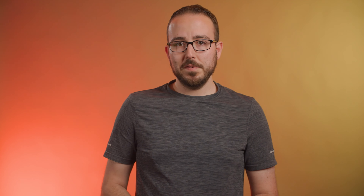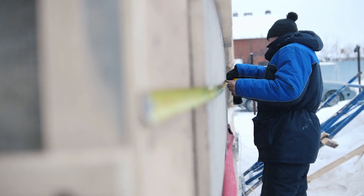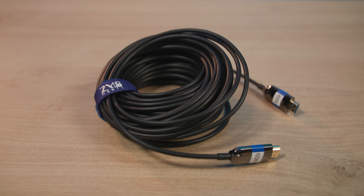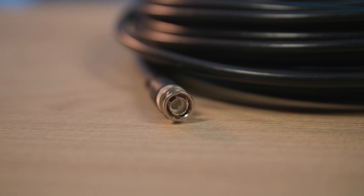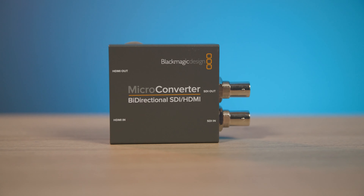If you need to do cable runs between 50 feet and 300 feet, you'll want to consider a few options. Option A is to buy what's called an active HDMI cable — these cables have a booster built in to boost the signal over a longer range. Option B is to consider buying HDMI fiber cables, which actually use fiber optic cabling but terminate with HDMI at the ends and can reliably run for hundreds of feet. Option C is to go with professional BNC or SDI locking cable connectors. 3G SDI cables are great for cable runs up to 300 feet. Anything longer than that, you'll want to consider using fiber optic cables and converting them back to HDMI or SDI at the ends. This can get pricey, so you might want to look at wireless HDMI transmitters as well. I'll link to the HDMI and SDI cables that I use in the description below.